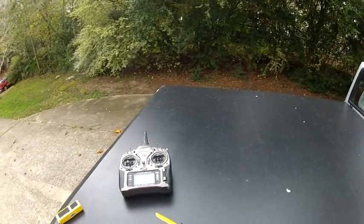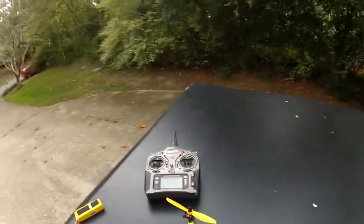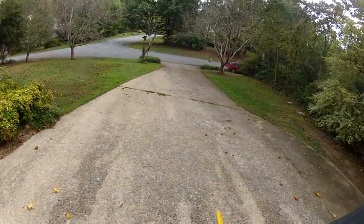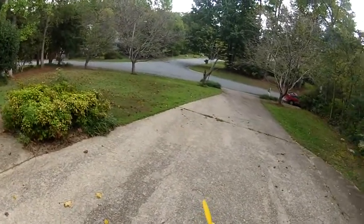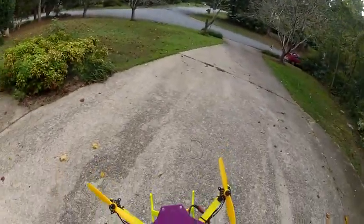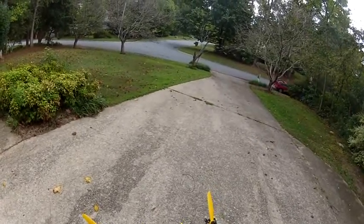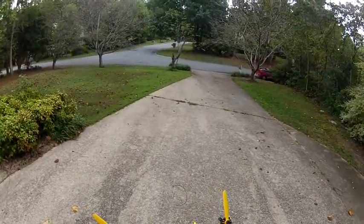I'm also going to fly it with a compact zippy. I won't worry about that yet. So I'm going to, man, this rain's coming. So I'm going to run the scale stick up. I'm just going to leave this battery up, and stick scaling. So its factory is 30. I'm going to go 120. And again, this is something you build up to, but with this storm coming, we just ain't got time to mess around with this. So I'm going to go 120, which won't be quite as high as I normally run it, but definitely want to get, oh god, the yaw is at 45, and I usually run yaw around 100.